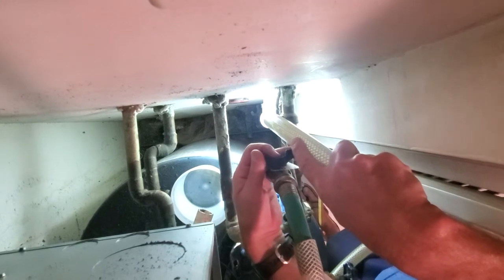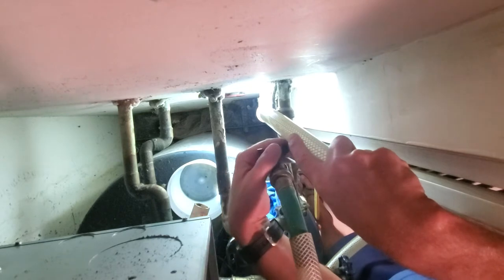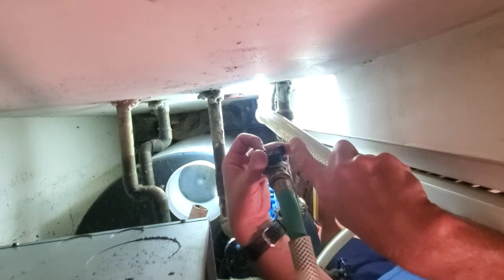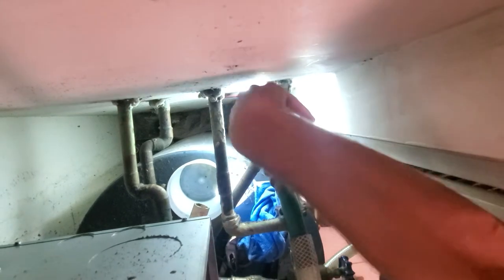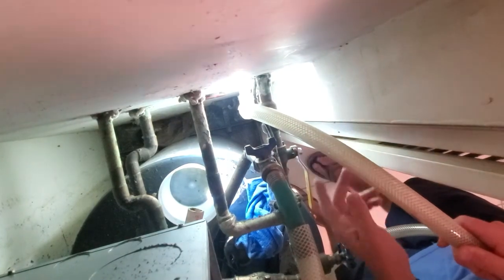It's good to do this from time to time. I'm in Florida so I've noticed that I really have to do it twice a year to prevent clogs. As I'm pushing the water right now it's not backing up, which means the whole drain is clean and there are no problems with draining. Everything looks fine, so I'm going to stop now, disconnect my hose, and go to the second part which is cleaning all my drain pipes coming out of my AC.